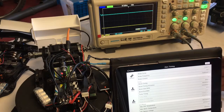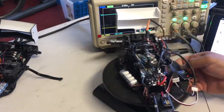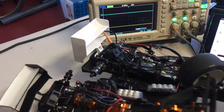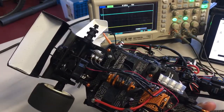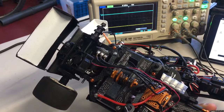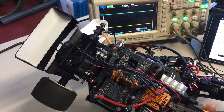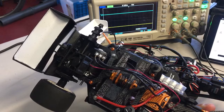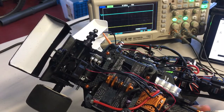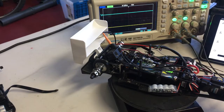So the big question is, why is this XR10 Hobby Wing showing timing at 1 degree, and this, which is the same thing, it's just an orange casing, this XR10 Hobby Wing ESC doesn't show timing until you hit 7 degrees on the timing setting. But regardless, once you take it out of 0 degrees or anything more than 0, it stops blinking. So any comments are appreciated if anyone knows what is happening here. But regardless, you can see what blinking mode looks like and what timing in the ESC looks like.